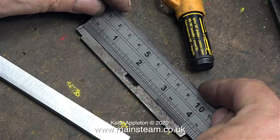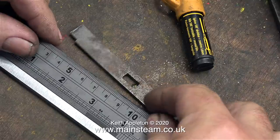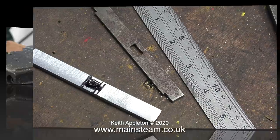In this clip I'm measuring the position of the hole in the centre of the original crossbar. My marking out is generally very messy, but it's only for me and I know where the lines are. I used the original crossbar as a template, laid it on top of my piece of steel, but the original wasn't centred on the bar anyway. So I re-measured it and drew two lines two inches in from each end.